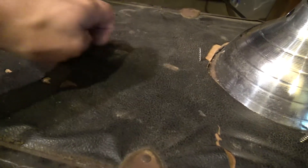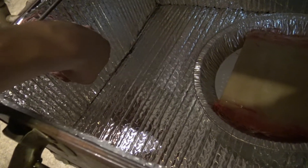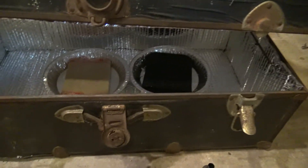The next step is going to be eventually adding a fan of some sort so I can cool it down if the temperature gets a little too high, and also cutting a hole so I can vacuum bag inside. But propping it open and leaving the lamp on has managed to keep it pretty warm in there. I'm definitely pleased — it's a very simple solution, but when it gets cold out it's really important to keep a warm temperature inside. When you're curing resin in general you want to maintain temperature; each resin has different cure times and it'll take much longer, and sometimes won't cure completely through a laminate if you drop below a certain temperature. So always read the directions on any kind of epoxy and remember that temperature is a very important factor. Even a simple little box like this will become very helpful.